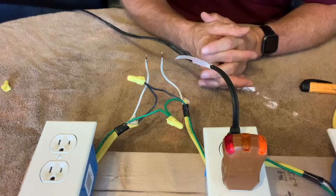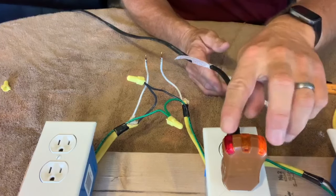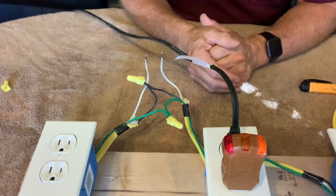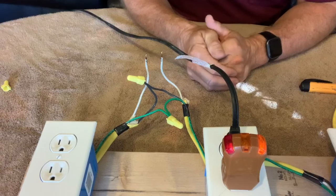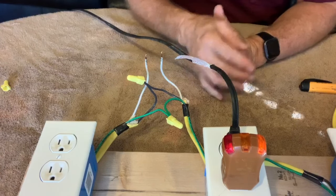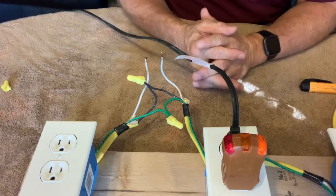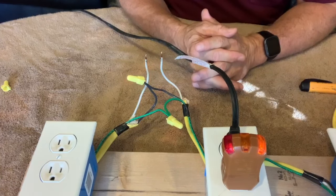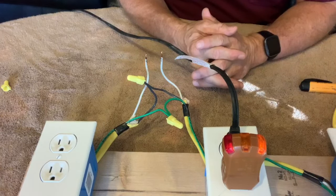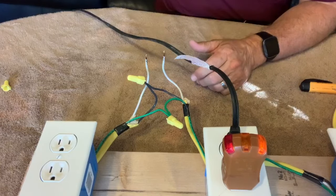The point of this video is to show you that you cannot always trust the indications you get on here. Sure, these tools are good for diagnosing certain problems and making sure electrical outlets are properly wired, but they can also give you false indications. In this case, if you didn't know better and you had an indication of a hot ground reverse, you may go start trying to diagnose where the hot and the ground wires got crossed in your house — and you're never going to find it because it does not exist. All you have is a neutral wire disconnected, a load plugged in, and that load turned on.